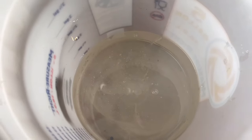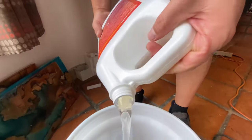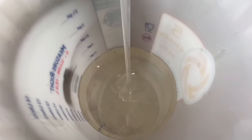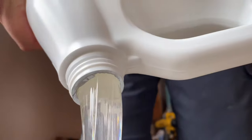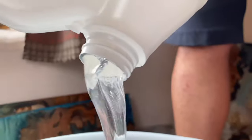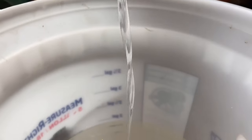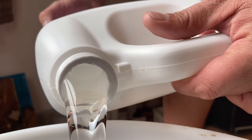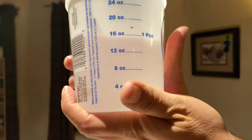So that's just a little pro tip: when you're mixing color use that mixer, and if you're doing a clear layer just mix it by hand. That way it's less bubbles, less pain and less work for you. When mixing deep pour by hand I always go nice and slow for about a good five to ten minutes, just to ensure that you don't have a lot of bubbles.